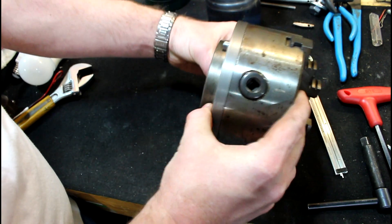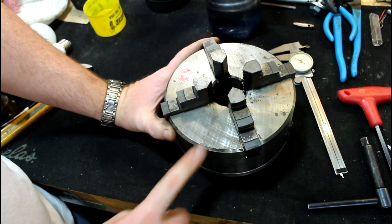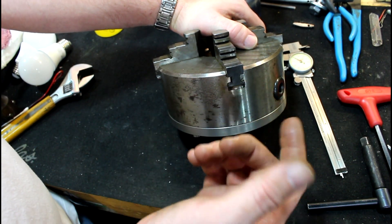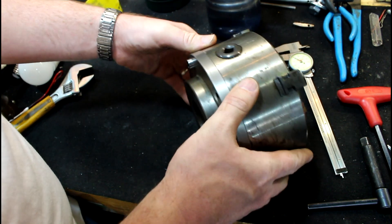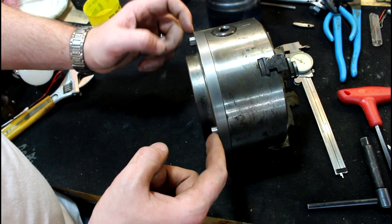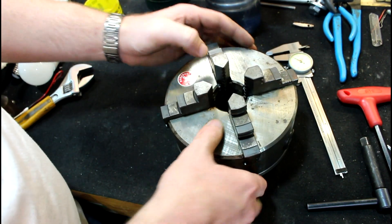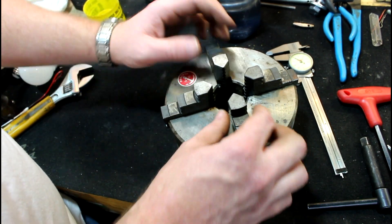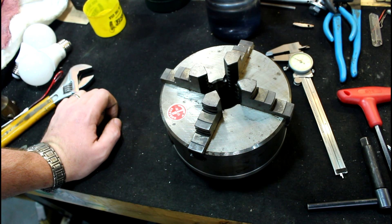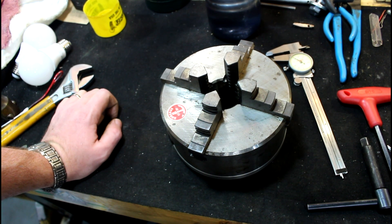Yeah, so that's it — first time putting on a back plate. Not a big chore I guess, but it takes a little bit of time to do it right. I did check this thing on my lathe after I mounted it: I spun it and I had just under one thousandth runout on the outside. I checked my plate and that had zero. I might have to cinch these guys down just a tad bit more and that might pull some of that over. But I think I'm pretty tight — if I can get half a thousandth runout on the outside, that should be all right. Not dialing anything after you cut this isn't going to be a big deal. Hope you guys enjoyed that — if you liked it, please be sure to like, comment, share, and subscribe. As always, stay safe on your machines and shoot safe — we'll see you guys next time, thanks for watching.